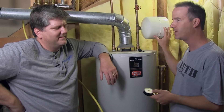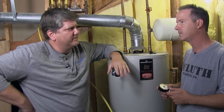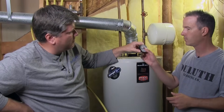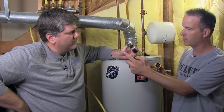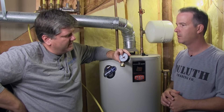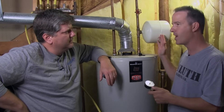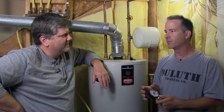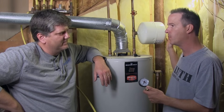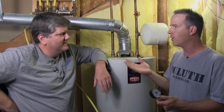The question is how many pounds of pressure do you put in there? Some tanks come pre-charged — the one I just replaced came pre-charged to 36 pounds. What you do is use a gauge with a hose connection, hook it up to your outside hose bib, and it will tell you your water pressure. If it shows 70 PSI, then you want your air pressure in the tank to be close to 70 PSI. So you match your air pressure to your water pressure, then monitor it once a year. If you're concerned initially, check it monthly until you're sure it's holding, then an annual test is all you need.